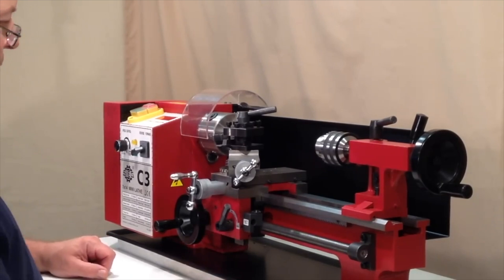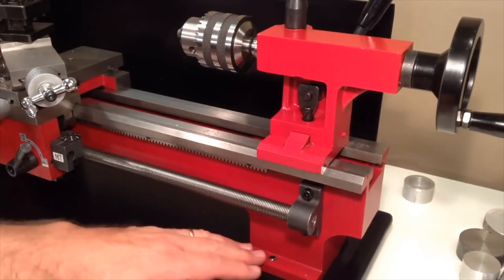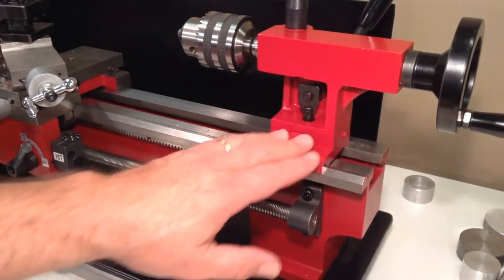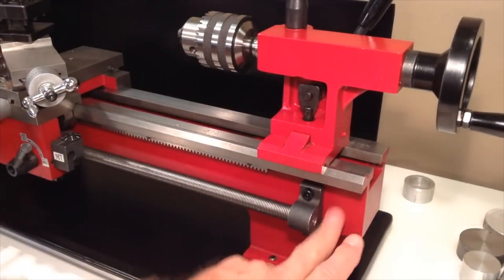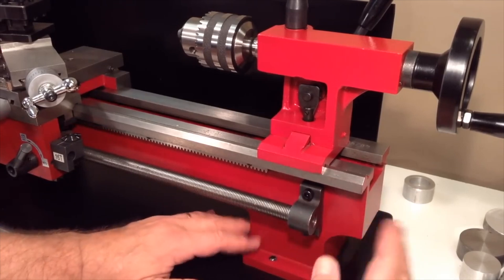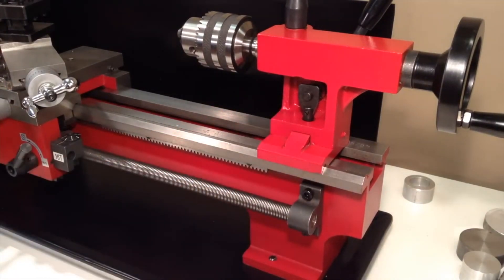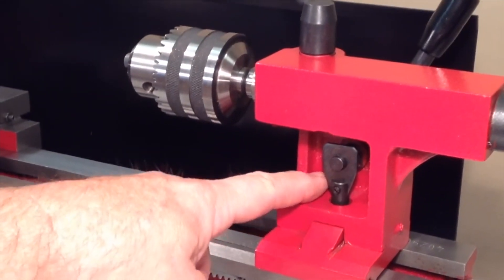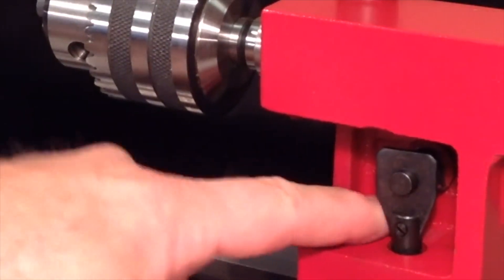The overall structure looks pretty good and the quality is good. I'll zoom in so you can get a closer look at the castings. Looking down at the castings at the end of the bed and on the tailstock, the quality looks very good — everything's smooth and nicely finished, the paint's good. There's no real evidence of body filler being used to patch up voids or gaps in the casting, which you'd sometimes find on early model lathes. Overall the quality looks great. If I zoom in inside the casting of the tailstock, back in the early days you'd sometimes find sand and grit back in these recesses left over from the casting process, but everything's clean and nicely painted in here.